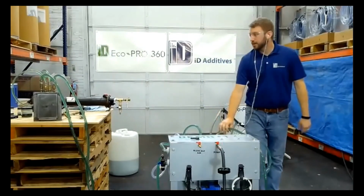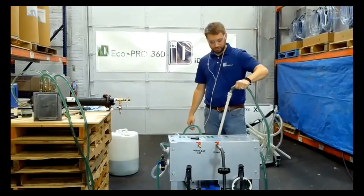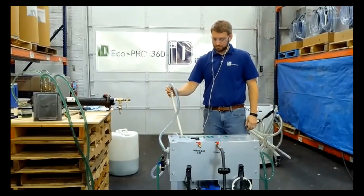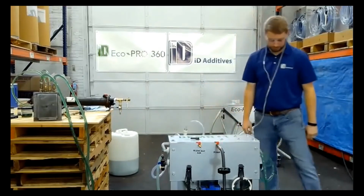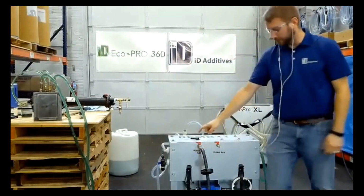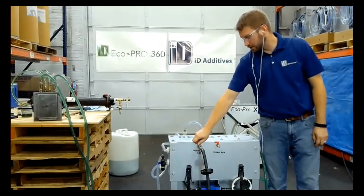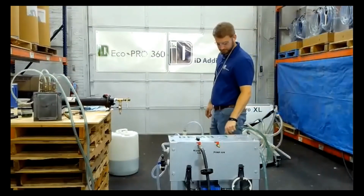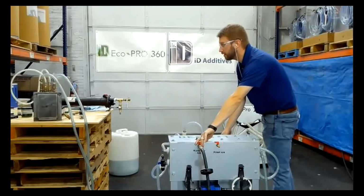So with that, again, I'm acting as if I've flushed for an hour or two. I pull my supply side, oops, I'm backwards. Let that chemical run through. Turn off my air supply. Swap the air over to the blowout. Again, the check valve on top. And I slowly turn that on until I see that air pocket come back to my drum. It should be right there. Now I can turn it on as much as I want to really get all that chemical out.